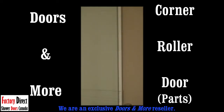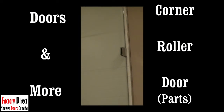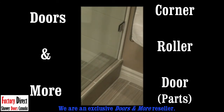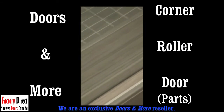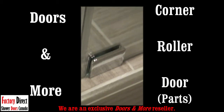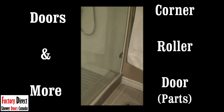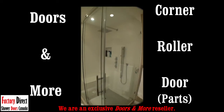There is no channel, there is no frame — something that a kit or a box door cannot achieve and will never be able to achieve. This requires an actual person coming into your home and measuring. Along the bottom there are no channels or any tracks; it's just silicone and glass touching the bottom. There is one more clip at the bottom for safety, which keeps this whole panel fastened to the base, and then you have two clips on the wall going up the wall.